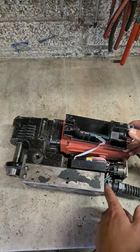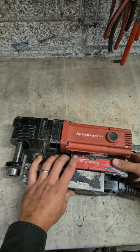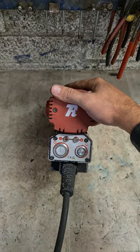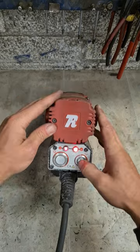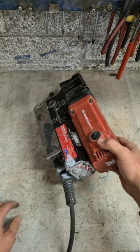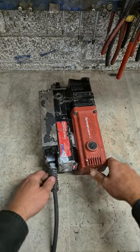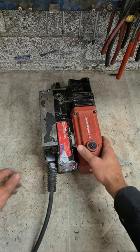Just make sure you're definitely not going to nip anything — it's a tight space in there. Let's see if it fixes it. That's better — magnet, that's better. Nice one, that was the problem. Broken sense wire for the magnet, probably stopped the machine. Somebody pulled the back cover off, pulled all the wires in, and just put it back together any way they could. But it was wrong — the switches weren't activating correctly. That's her up and running again.